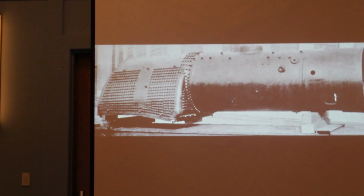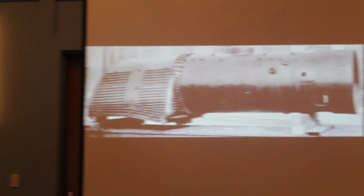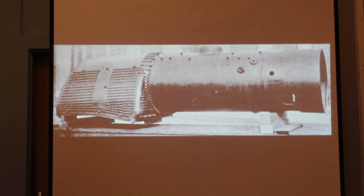working pressure, everything the same. And there were a few other roads that were very aggressive. Roads such as the Northern Pacific, the D&H, the C&O, C&NW, and the Milwaukee Road were very interested in using welded boilers once they became acceptable, because of all the reasons we talked about. A few roads, like the New York Central and the CP, purchased 1 or 2 of them just to dip their toe in the water. But the problem was, at that time, steam was on its way out. It was in the late 40s, early 50s.